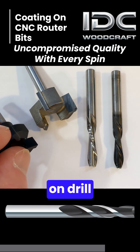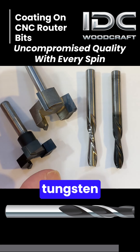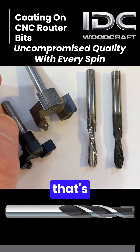The different kinds of coatings that can be applied are black oxide — this is something you would find on drill bits — then there's cobalt, that's when you see the gold drill bits, and then there's tungsten and titanium coatings. The one thing I want you to understand is that coating is not something that's adding strength to your router bit.